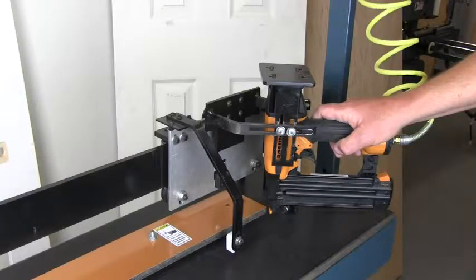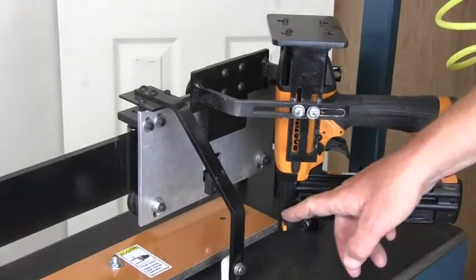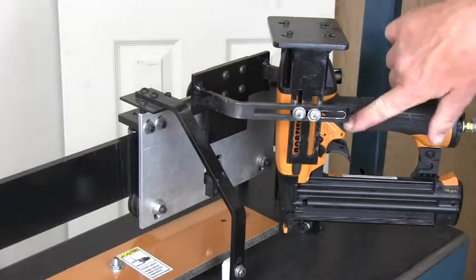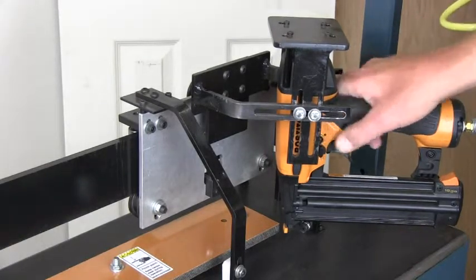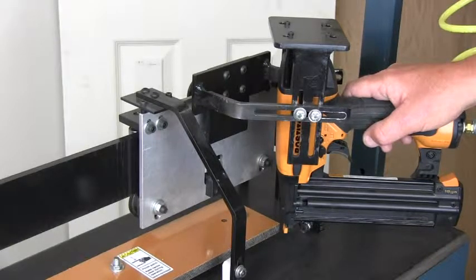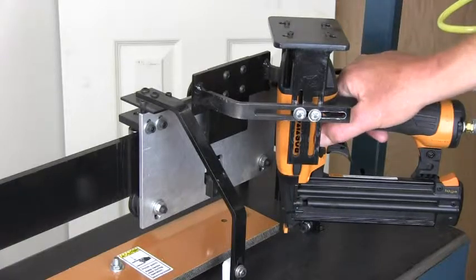The Bosch stitch gun that is used on this 440S has had the nose safety removed for use on this machine. There is, however, a trigger lockout safety on it. We'll push it to our left to unlock the trigger, back to the right to lock the trigger. The trigger lockout control should always be applied when the gun is not in use.